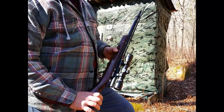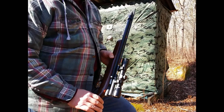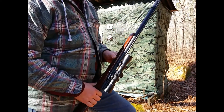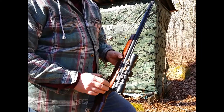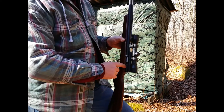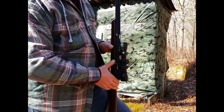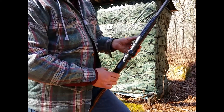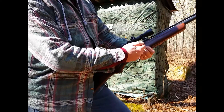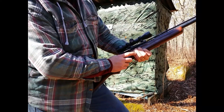What we've got here is a QB-78 air rifle that I bought. It had already been modified by a guy named Troy Manny — you've probably seen some of his posts on the Yellow if you visit there often. What you're looking at is the hammer and cocking knob assembly engaged with the sear. Basically, what I've done is eliminated the bolt and sealed it off so that the air comes through the transfer port and straight out behind this tube, which becomes the launching tube.